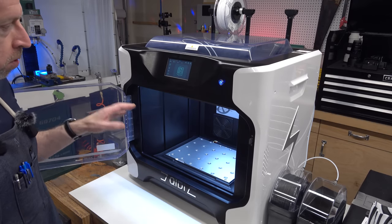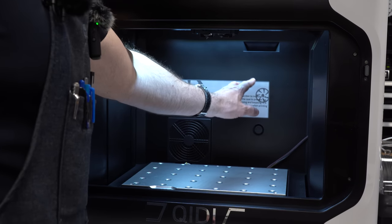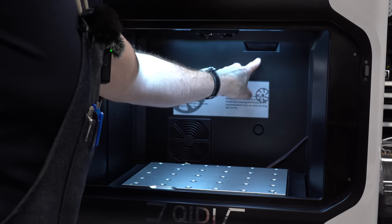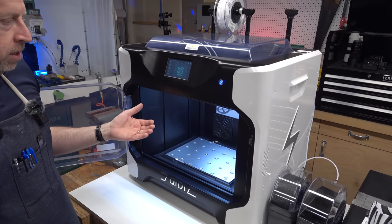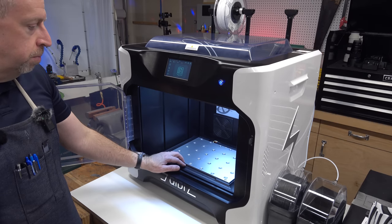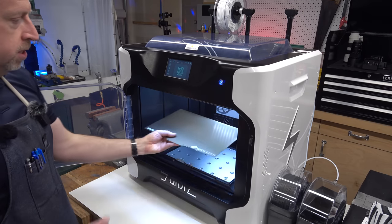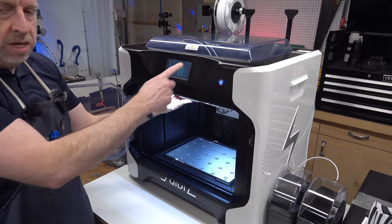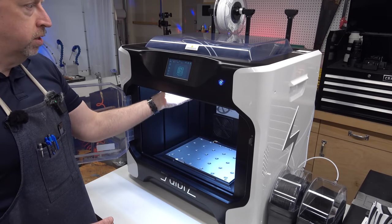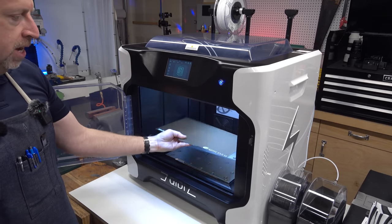This chamber is actively heated. There's a small intake fan inside and an electrical resistive heater in the back — you can see aluminum heat sink fins if you look into the port. It draws air in, blows hot air out the top, and heats the chamber to 80°C. The marketing materials say 60°C, but the presets say 80 and it gets there no problem. When printing starts, the bed is all the way up so only the volume above the bed needs heating, and within a minute that top volume is at 80°C and maintains it throughout the print.